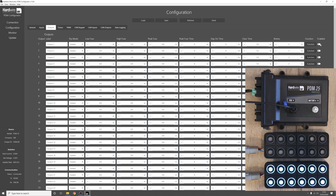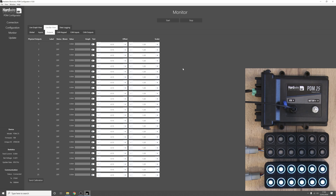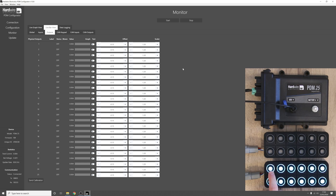Enable each output and press send, press ok, go back to the monitor tab and go to outputs. Now if we press the button, the button goes through the different states as before, but you can see the outputs turning on sequentially — output one is on in state one, then output two, then output three, and then back to the off state.